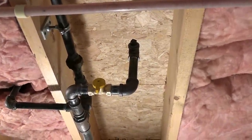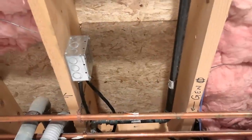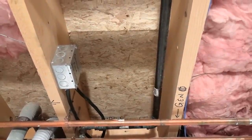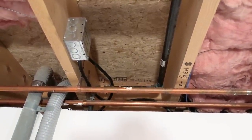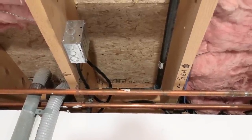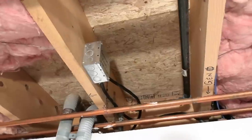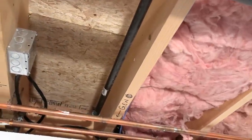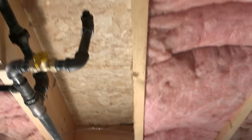My initial determination for the length of this nipple was based on a limitation imposed by the presence of this electrical box, which feeds back from my generator at the barn to the house. That presents another issue: on close examination of the measurement outside, I did a test hole and it falls within about an inch of the side wall of the den — that's not acceptable. So what I'm going to do is simply remove the obstruction: remove that box and reposition it to the other side of the bay to the other joist. With that I can install a larger nipple and run it more closely along the joist.